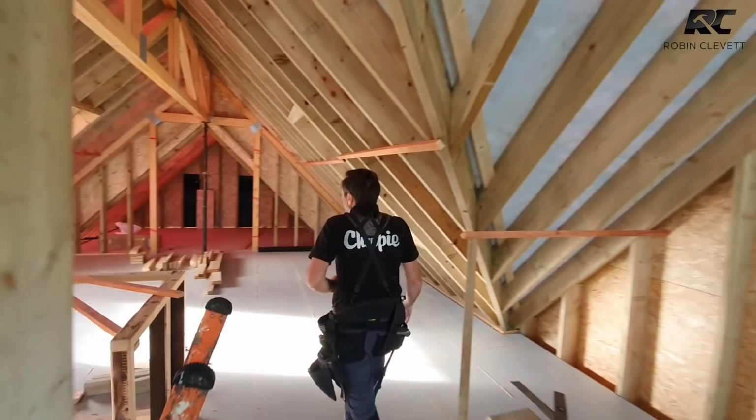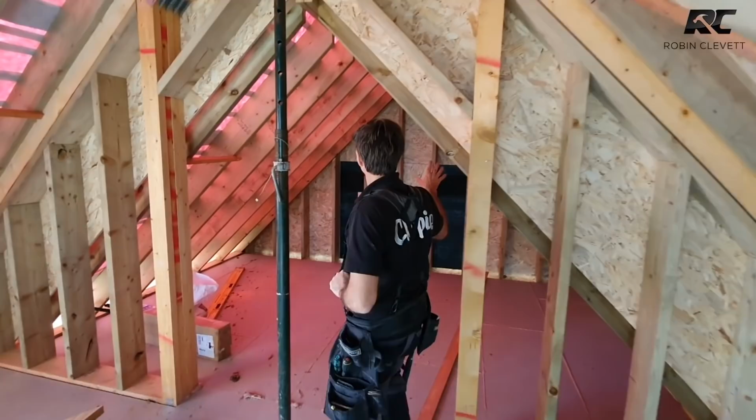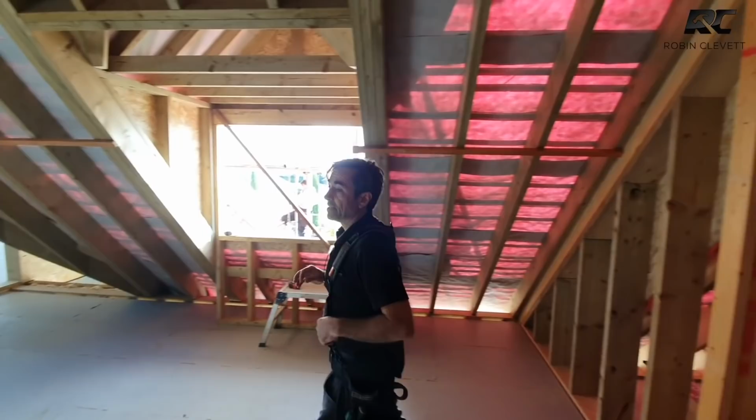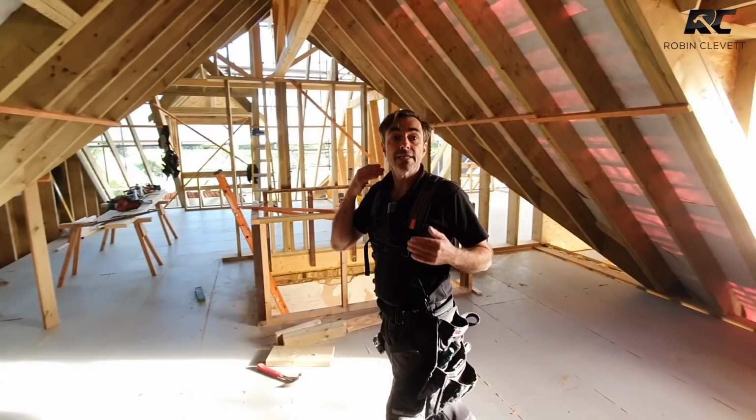So this is the second lattice truss. It's actually the longest single spanning truss on this job. It's about 7.1 meters. And then this is a small gable end roof on this end as well. So you can sort of see the scale of it. It's gone together really, really nicely. We try to make sure that we get everything square, level, plumb, true. And so when we're manufacturing all of our rafters, it's a matter of cutting like, you know, 20 of one, 30 of another, and they're all going to go together perfectly. They're all going to fit together really well.